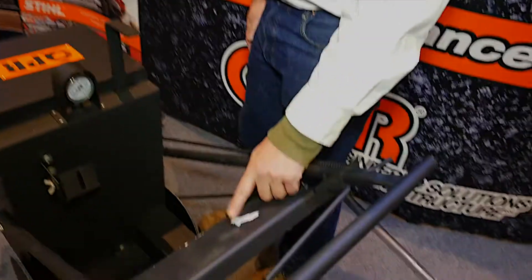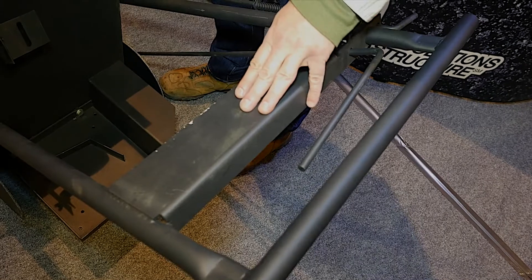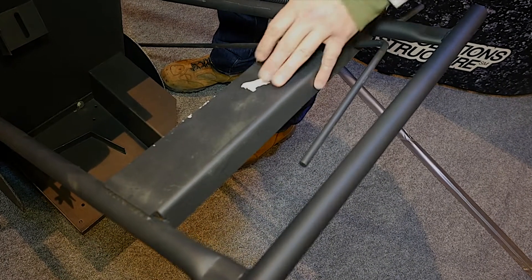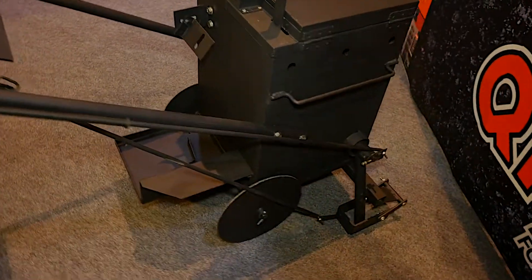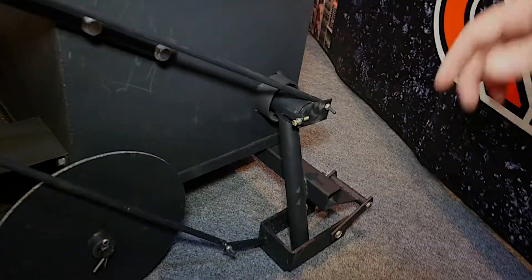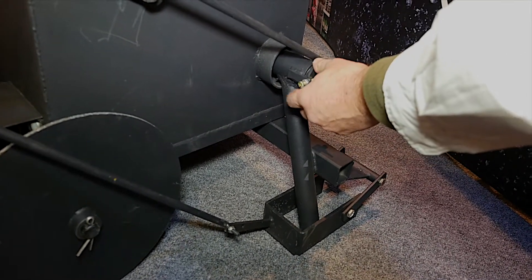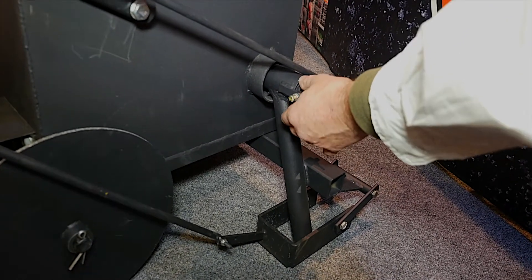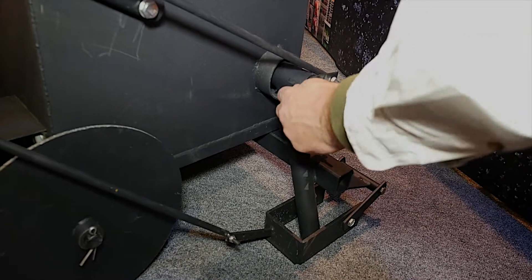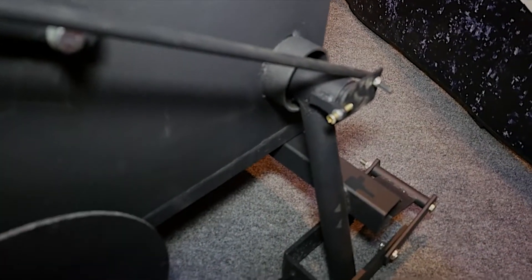The front label — which both competitors and what QPR has had in the past has been a simple plastic decal — will now be a really nice aluminized metal label. It should look good and be extra durable over time. The unit is compact and can be disassembled very quickly. Down here, all of this can come apart with just a simple wrench and screw. Before, the only way to clean it was to take a torch to it. Now you can just take this off, drop it in a one-gallon pail of diesel at night, dissolve everything back, and within four or five minutes the next morning slide it back in — all clean without having to heat and bake it.